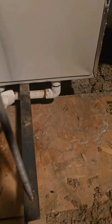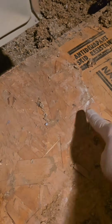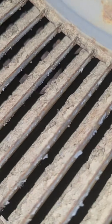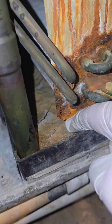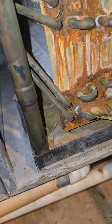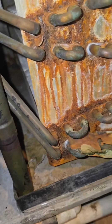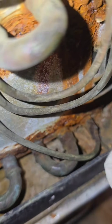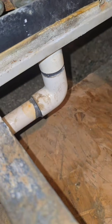We already noted there was no emergency overflow pan, and we can see that in the past it has been leaking water — this existing staining here. Here's where I sprayed the disinfectant. Take a look inside — it is literally caked in there. We're going to note all of this buildup; that's slime from the summertime. We can see how the drain area is all built up around where the drain goes — there's the drain hole and then the drain line straight below.